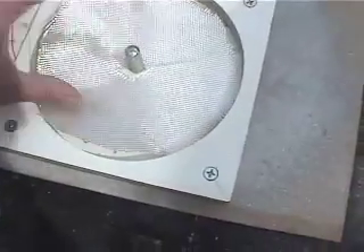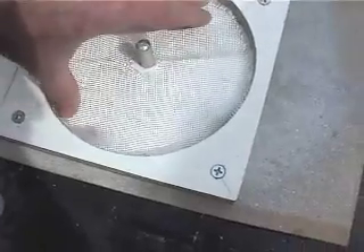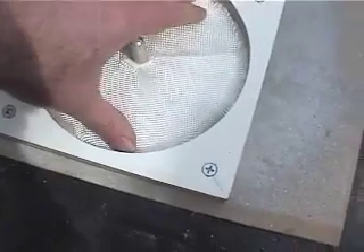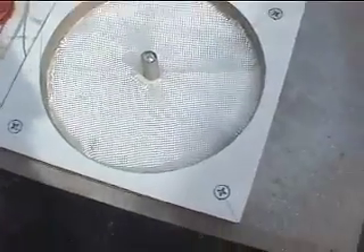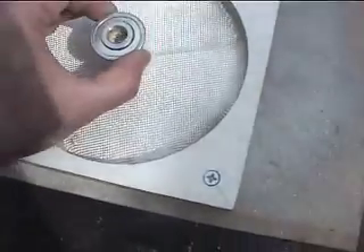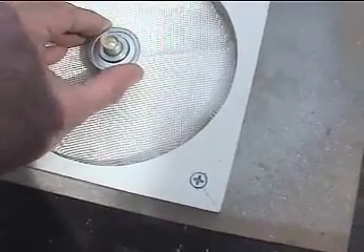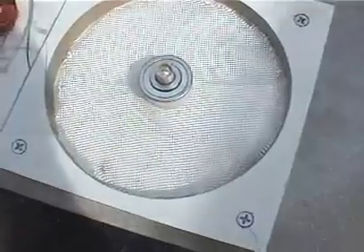You want to pre-cut your fiberglass mat to lay in there — that'll help strengthen the polyester resin. And I've got a spacer here so that my bearings don't go in too deep, so that'll lay in there just even with the stator.